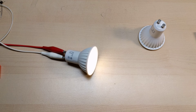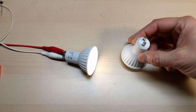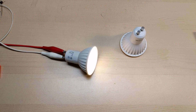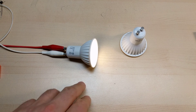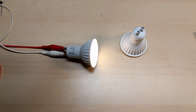So let's just say if you want really, really low power and pretty dim LED lights to put in your halogen fixtures, these one pound or $1.40 Poundland lights, when used in the United States, will actually work for you. Of course, if you've seen Big Clive's videos, if you take them apart and you remove the power supply — the capacitive dropper, the main capacitor — you can just change the value and get something that would be a bit more acceptable for the US, and have this run at whatever brightness you want. You can control that.